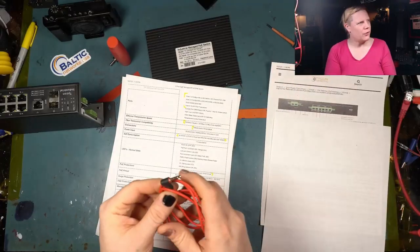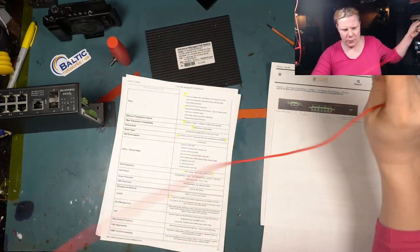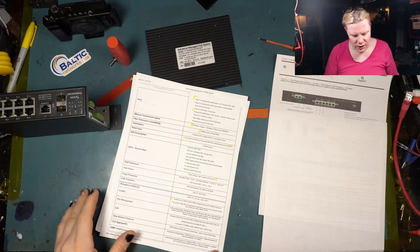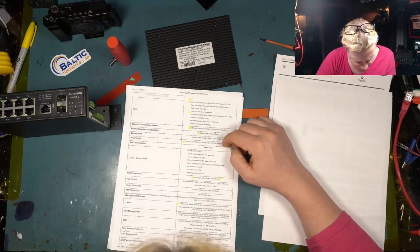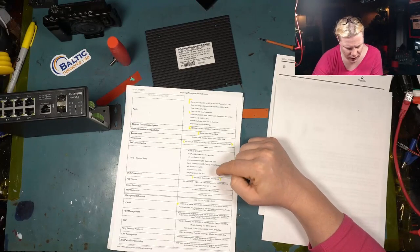It comes with this awesome little three-pin cable, about three feet long. On the side you've got a port for a thermal/humidity probe, which allows you to keep an eye on your enclosure — so if water gets in or anything like that, you can be aware of that. PoE protection — over voltage, over current, and short circuit — just like any other regular industrial PoE switch. Pretty much every PoE switch, passive or active, has port protection on it.